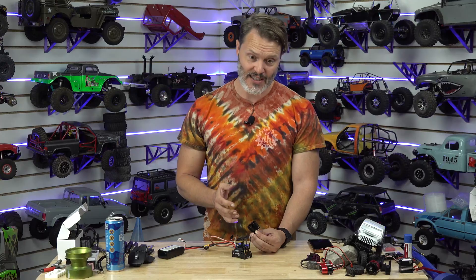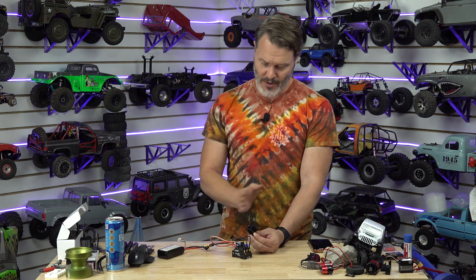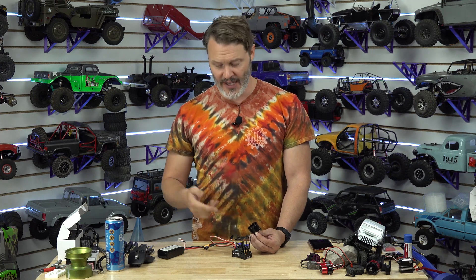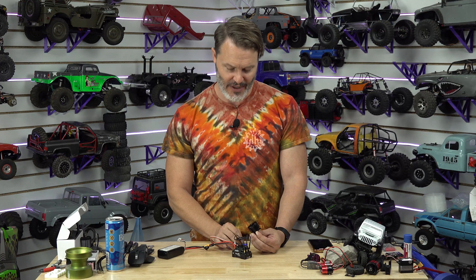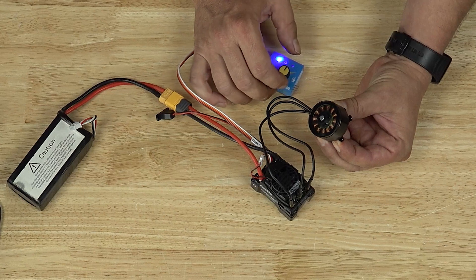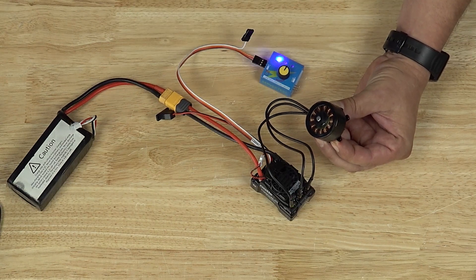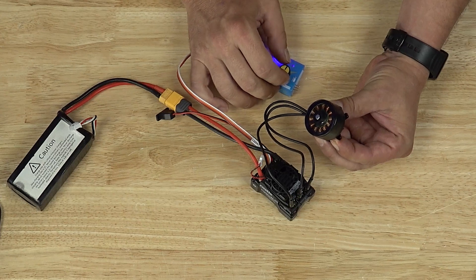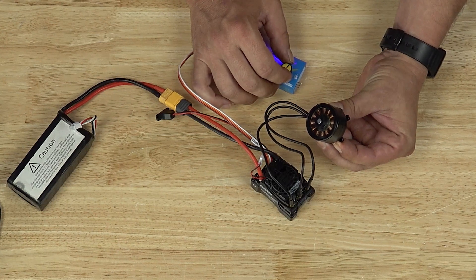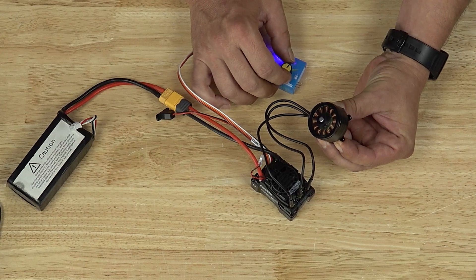I'm imagining they've got a dithered mode in their startup RPM range where you actually reduce the switching frequency. A reduced frequency would be somewhere between 8 and 13kHz from what I'm hearing, which is right in the middle of where these motors like to reverberate and where your ear is very sensitive. Then once we get out of that initial startup range and PWM is high enough, it pops up to something like 20 to 24kHz switching frequency — far quieter than other Castle controllers.